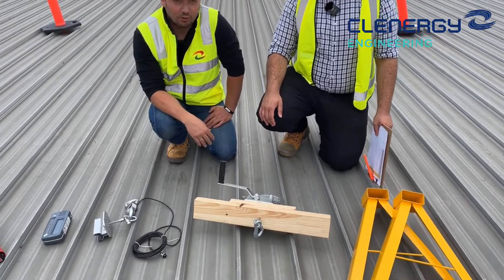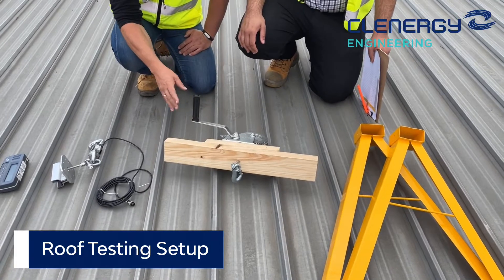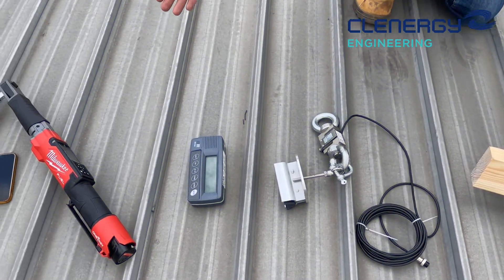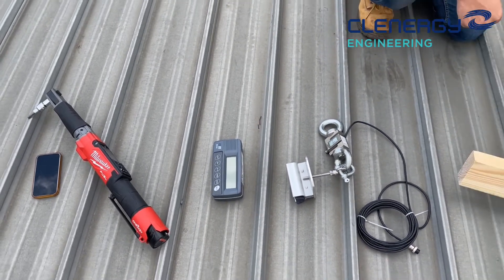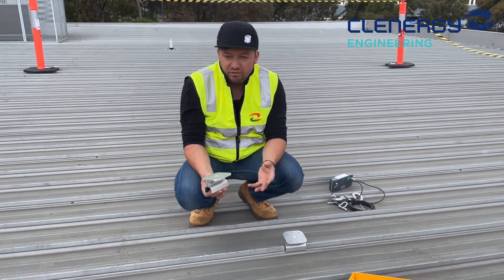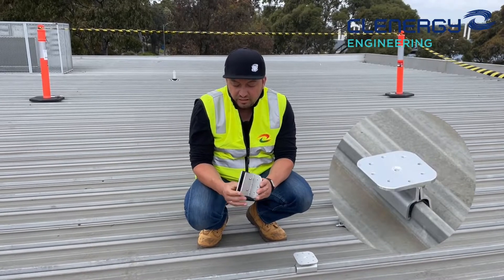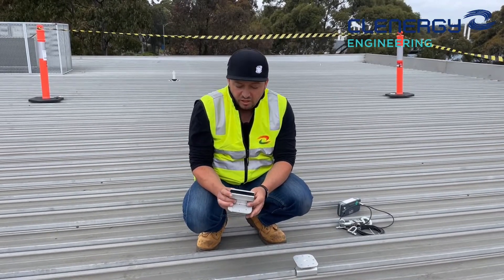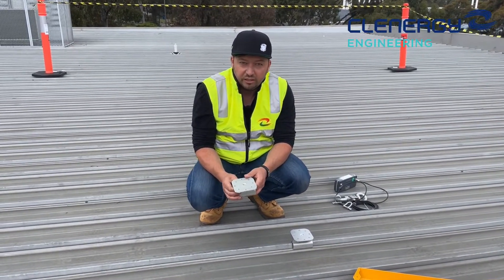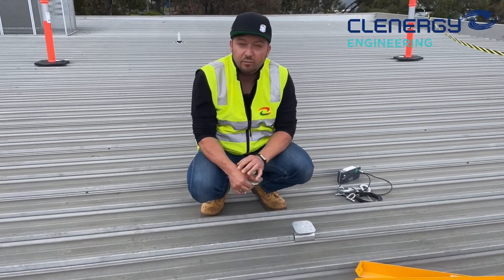We have our kit for clip lock roof testing, which consists of our sawhorse slab, the winch kit, the load cell and the reading device, as well as our torque wrench and a phone to take pictures. The roofing sheet we have on hand today is a 700 millimeter clip lock roof, which we couldn't identify the exact type of. This is why we checked this bracket to see if it works on it — it's a perfect fit. So that's why we decided to test today the erio9 bracket, which is actually our first clip lock bracket, and this is what I set up earlier.